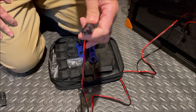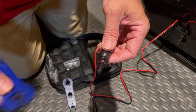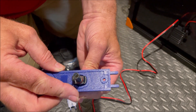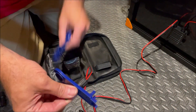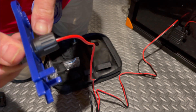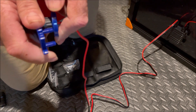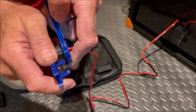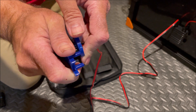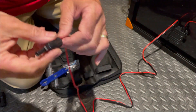We take our rubber portion and push it in, then move up the cap and screw it down until hand tight. Now it's time for the connector wrenches. The center slot fits right over the MC4 connector, and the outer ribbed slot goes over the ribs of the connector. Slip it through the wire, put it over the ribs, and tighten it down until we hear it click a couple of times — that clicking means the wrench is slipping over the slots when it's tight. We heard it click three times, so the connector is done.